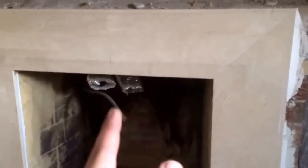When we do a gas fireplace conversion, we actually have to put a special aluminum liner right up the chimney, and that's what these two aluminum ductworks actually run up inside. So it's not just the bare brick like it would have been in an old gas fireplace — there's a special liner that runs up. That's the first thing to point out.